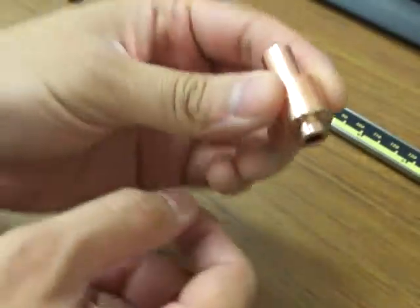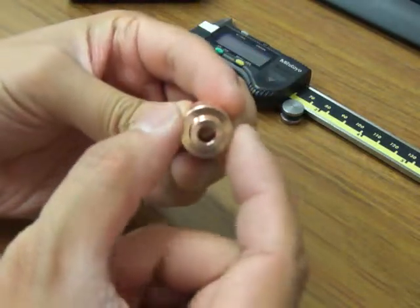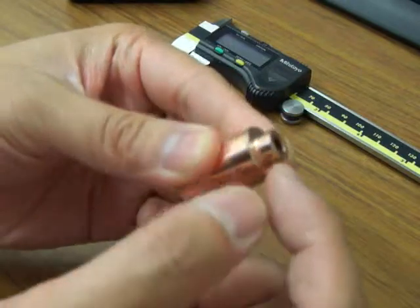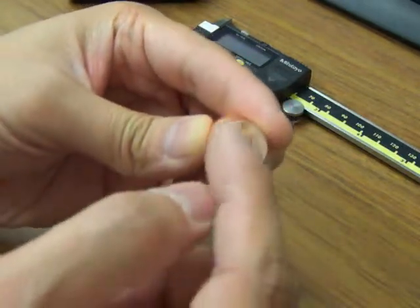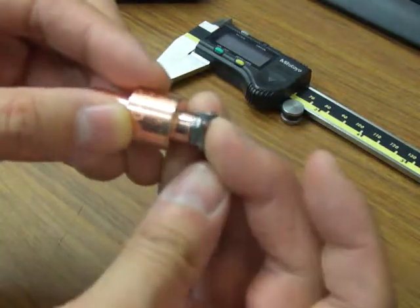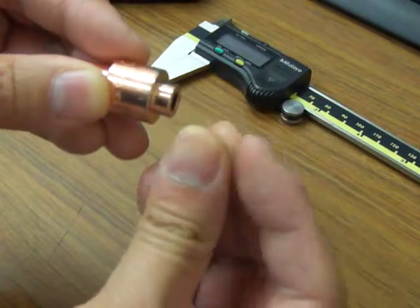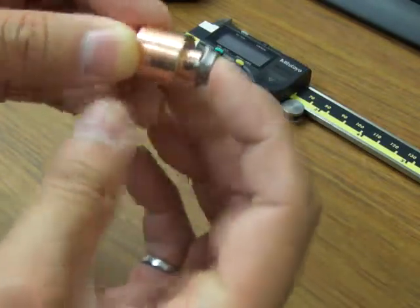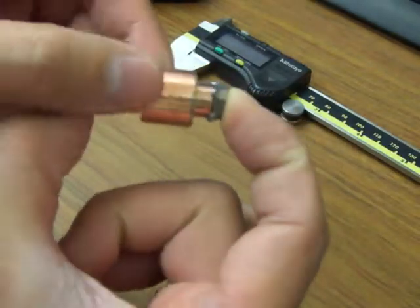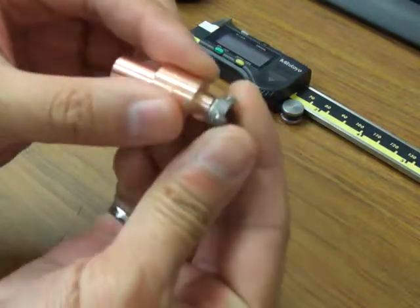What we have is this style of electrode — basically without the shield around it. We're no longer using a shield like we were before; we're just using the tungsten face and we're tailor-making that surface so that it will weld the nut properly. But if the nut is upside down for some reason, this actually fits inside the projections so that the height of the entire assembly is different.